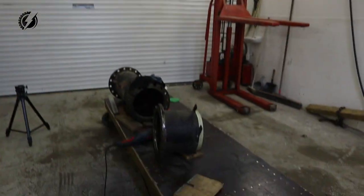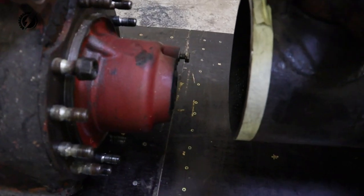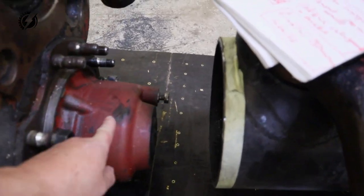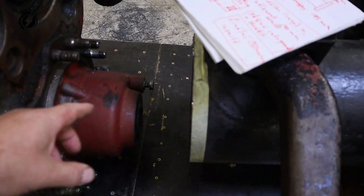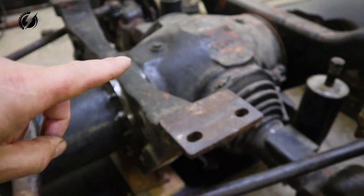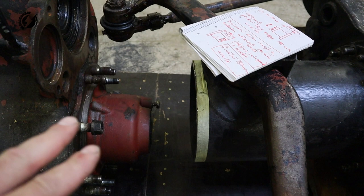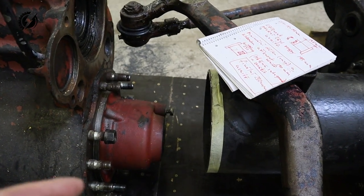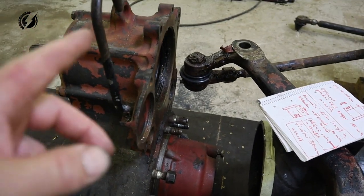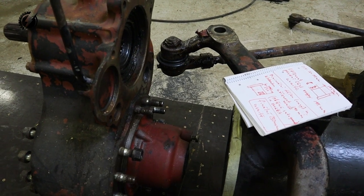Okay, guys, I'm getting there. I just disconnected this part of the tube, and we are going to put it here, exactly into this gap for the cylinder, which was used for engagement or disengagement of the front axle in the original Tatra. We are still going to keep it there because if I have some mechanical failure and need to be towed, I need to disconnect the motor, otherwise it would be hard to tow the vehicle. That's why we keep it there.